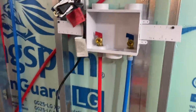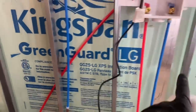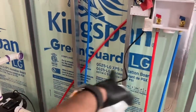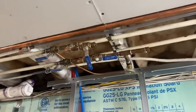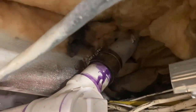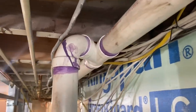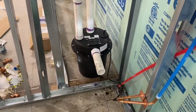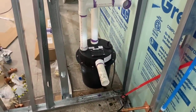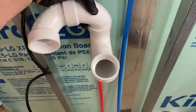There's my washing machine box — missing other things today: half-inch press tee, half-inch expansion tee to tie in the two water lines. We've got the no-hub coupling, two-inch with the two-inch Y, tee with the clean-out, the Y with the 45, the check valve picking up the WRSC-6 five-gallon Little Giant laundry pump. This tee is gonna come across here when they frame out the wall and pick up the trap right there.